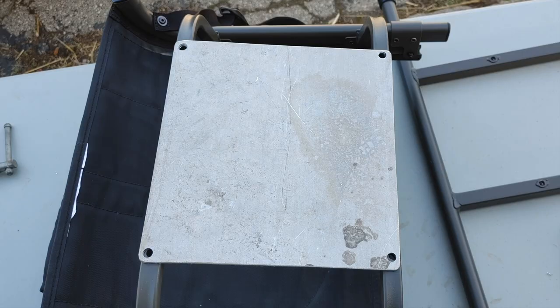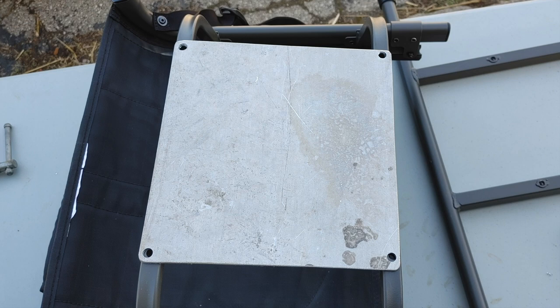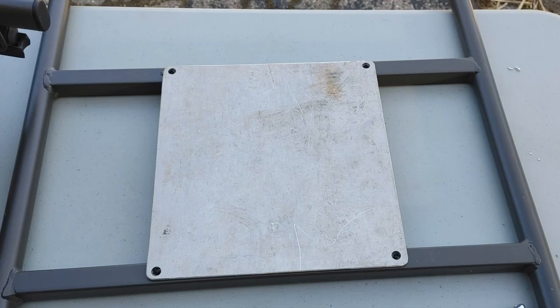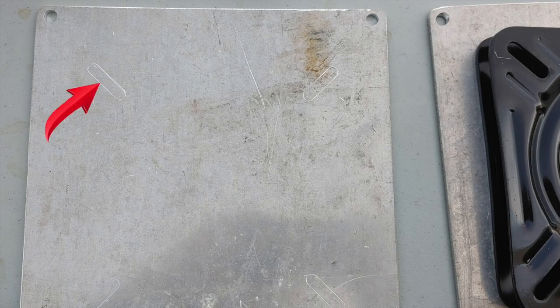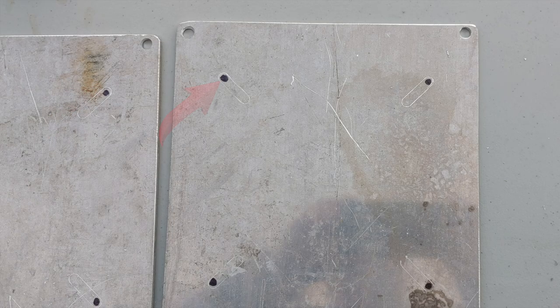You can see the hole locations and I've center-punched them — they're ready for drilling. Here it is drilled out and set on the bottom of the seat bracket. The other piece is now on the lower frame unit, so we'll have to bolt both of those pieces to the appropriate frame after we drill the holes for the swivel. Set the swivel on your mounting plates, locate it where you want so it won't be too close to one edge or the other, and then mark the holes — or the slots in this case. You'll drill a hole for the bolts to mount the swivel to the mounting plates. Here the holes are drilled out as far as they can be in the slots to give it more stability.